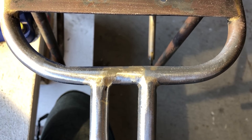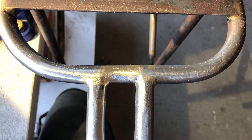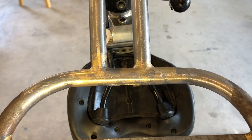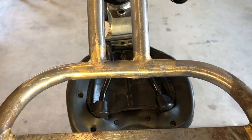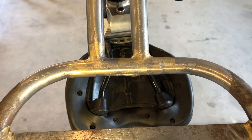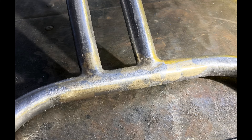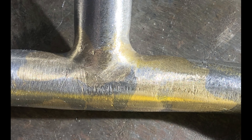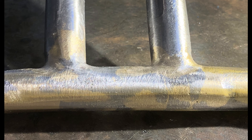Here's the top side after I finished filing and sanding. This is the side of the bike rack that people see, and I was not brazing on it today — it just had some stuff drip down on it, so it looks good. I reinstalled it and it did not crack, because we had filled the crack while it was installed on the bike frame. I'm going to include some close-ups of the repair at the end of the video. Thanks for watching.